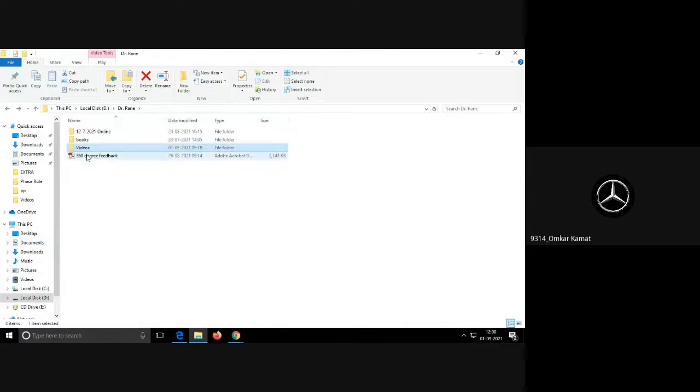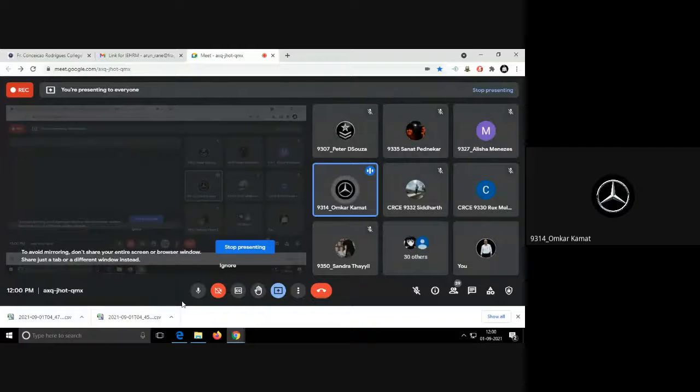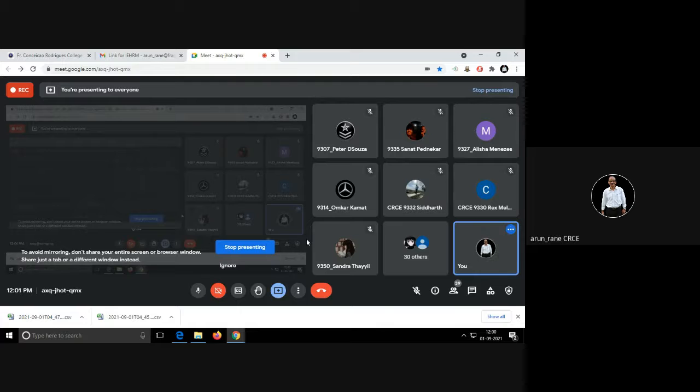Sir, but how can it be made in the middle, sir, without connecting to the rest of the part? It can't. Sir, we saw that the finished product had material in between. So how can that die be made, sir? It should be in air for that type of extrusion. Wherever in the die there is a hollow, that much shape will be extruded, I say. And the remaining portion you will automatically get hollow. Okay, sir. Understood.